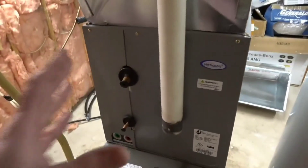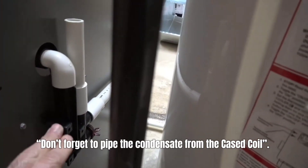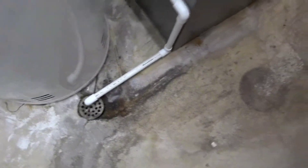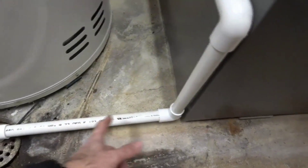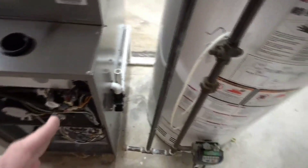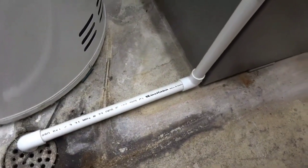Today we're going to be piping in our case coil, cutting our venting back and installing our venting to the furnace — and here's our drain off the furnace. This particular Lennox comes with a kit and what you want to do, as it's in the manual, is have a stand pipe that comes off the vent that is no more than two inches above the outlet. We're also going to cut in a condensate neutralizer right here — that's really important because these high-efficiency furnaces produce acidic condensate, which can actually start to eat away metal drain materials and anything metal. So it's very important to install a condensate neutralizer on a high-efficiency heating appliance.